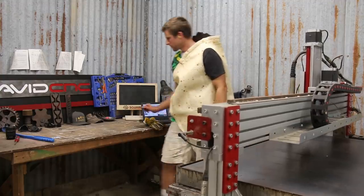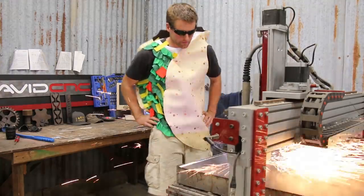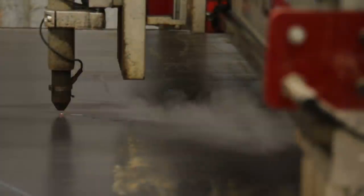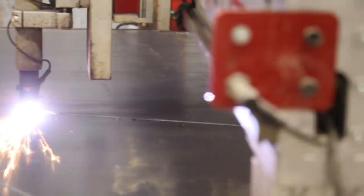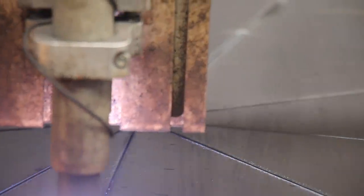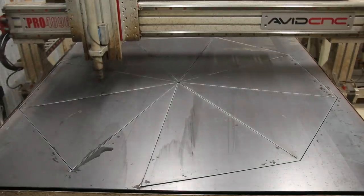My project that I'm about to taco about is a quick and dirty fire pit design that I threw together for the gravel driveway outside the barn. I designed an 8-sided dish with fold lines cut into it and a stand to hold it off the ground about 20 inches or so. It all fit onto one sheet of 3/16-inch plate. I'll throw the DXF file in the description below if you want to take a look.